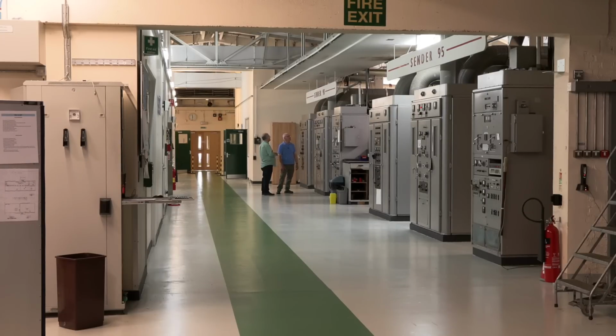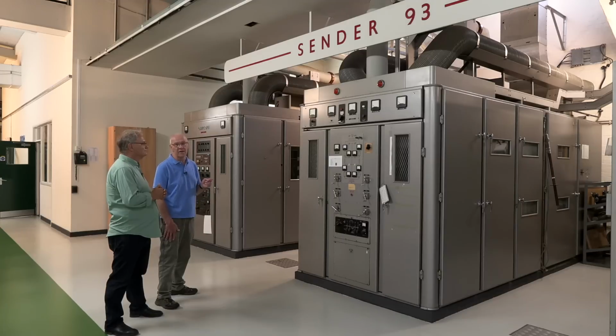So why did VOA think that you needed a load of new transmitters here at that time? Well, because of course in the early 60s there was the Cuban Missile Crisis and the Bay of Pigs disaster, and tensions were really escalating between the two superpowers. So they paid to have the transmitters here upgraded. They removed 4 50 kilowatt senders and replaced them with 6 250 kilowatt senders, and this was the first one to be done.